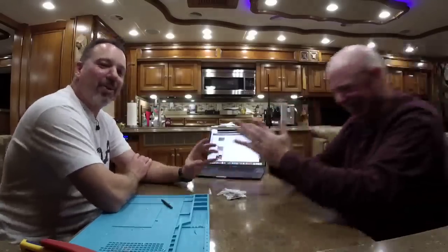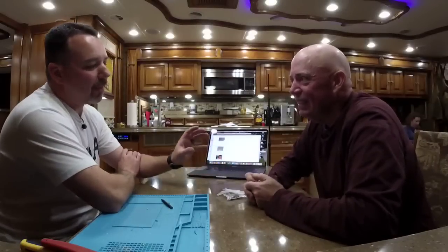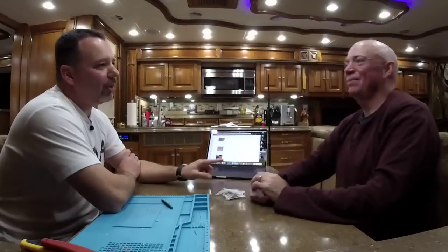So it lets you charge your electric vehicle off the same 50-amp plug that your coach is using, because it monitors the amount of power your coach uses and tells the electric vehicle charger how much is left over to use, so that you don't trip a breaker. And I did already say that earlier in the show. Oh, so yeah, I did give it away. Well, we talked about it. You talked about it on the live drive too.